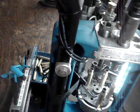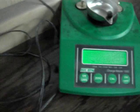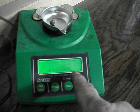So the roller cam follower smooths out a lot. And the other thing that I've done was I took the original detent ball from Dillon, a chunk of steel that weighs 54.2 grains, enough to knock over a horse, and I replaced it with a phenolic industrial grade bearing, and this is not just a chunk of plastic, that weighs somewhere under 9 grains or under 10 grains.